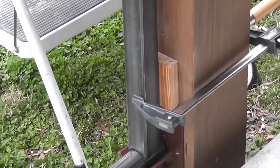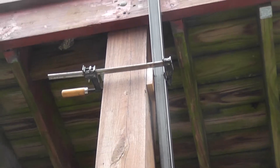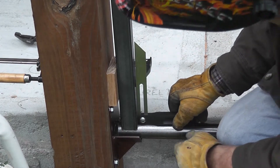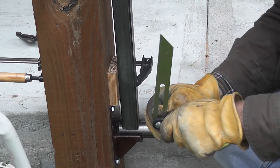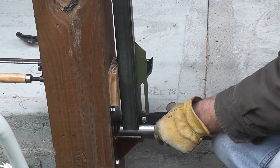We got this temporarily clamped in place — I got a block spacer there in between, and I have it up higher too. We're going to try to set the angle for welding here. There's another block up higher, and it's going to go all the way up to the top. Overall it's about 12 feet, so let me take my angle finder here and see how close we are, lock it in real good, and then take it over and use it to weld with. If it's a little bit off that should be okay because we could tweak the piece on top when we weld it.